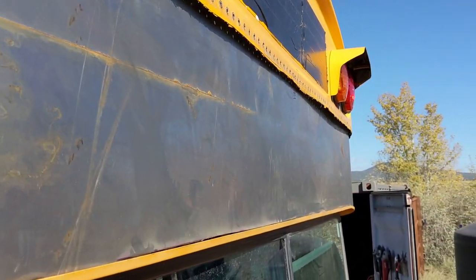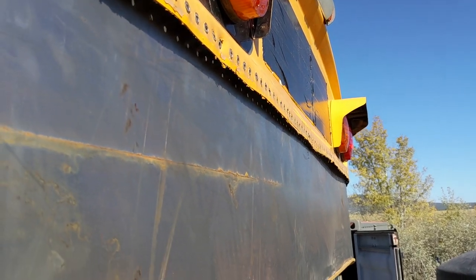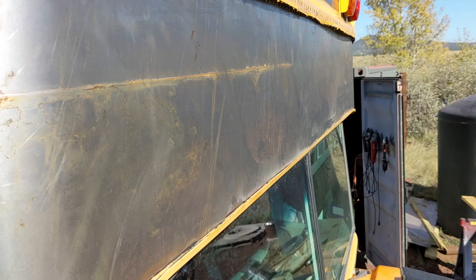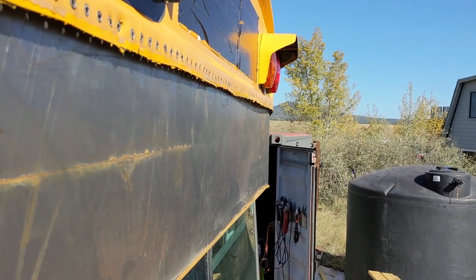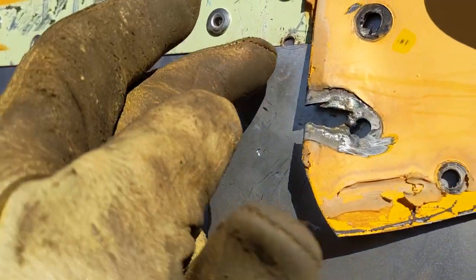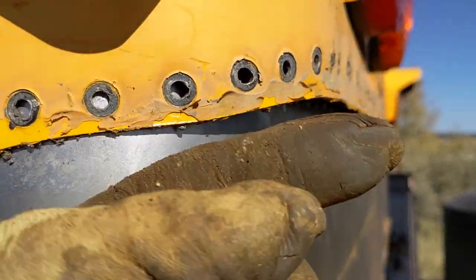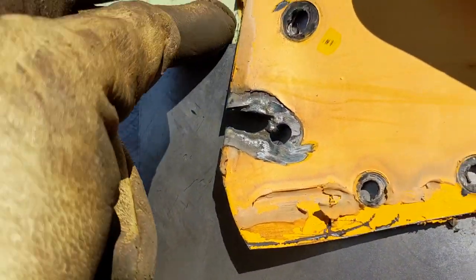The trimming is done and that fits in nicely. So I've still got to clean up this edge. Let me start over. I trimmed the bottom, took about a quarter inch off on that side and nothing over here. Just like the other side, this side's run a little bit long. And then once I get this gap filled by pushing and riveting the metal forward, then I will know how much to take off over here.